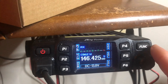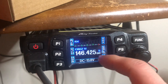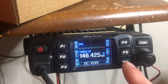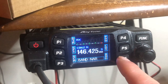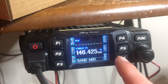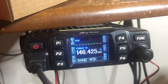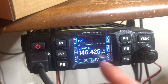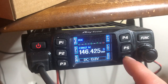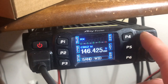How do you do this on the AnyTone? You want to hit the function button here. See on the side, you have all these terms — these are little quick menus. Hit the function and see the one that says band? That would be P6. If you hit that once, you're in narrow band. A lot of people forget — you don't want to be in narrow. This one does narrow, medium or mid, and wide. Wide band is going to be your full bandwidth. Your voice will be clear and crisp, just like you would hear on FM broadcast. So you beginners out there, remember you want to be in wide band. Just cycle through and it will be in wide.